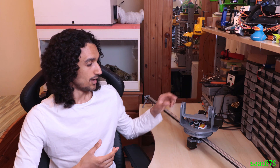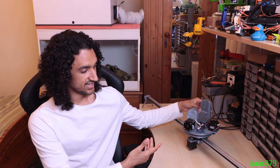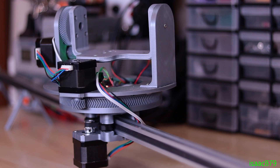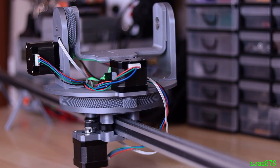One of the main limitations of this design is that the slider makes quite a lot of noise. It's mainly due to the stepper motors and produces a lot of vibration, which the internal mic on the camera will pick up and basically render the audio useless. This isn't a massive problem for me because most shots I want to film don't actually require audio anyway. Another limitation is that the pan axis can no longer do 360 degrees because the wires from the slider will get caught around the rail and prevent the motion or possibly rip out — though on a slider you're probably not going to need 360-degree rotations anyway.